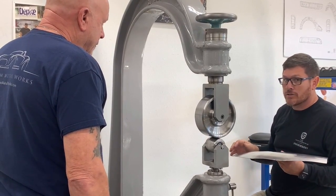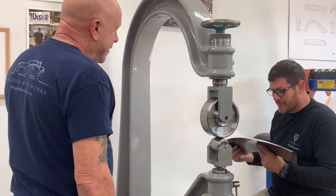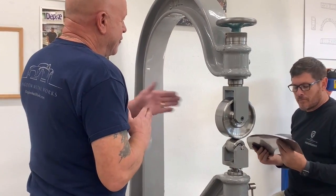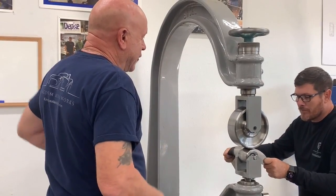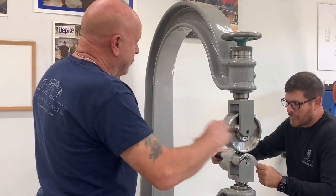Keeping those bite marks close together. The track marks? Yeah, good, good. Yeah, it's a lot going on. You've got double curvature on the panel. Your blow marks, you're trying to keep the tracking perfect. And at the same time, you put a little English on it too. Plus, trying to make the panel go the right direction.